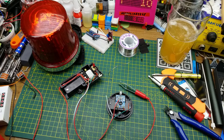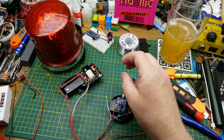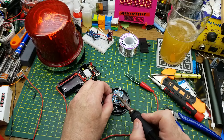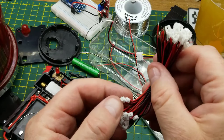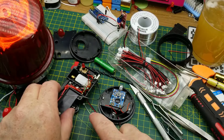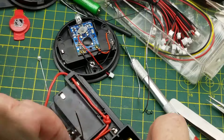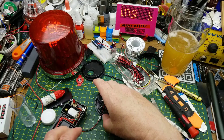I'd like it to be reversible because I don't want this permanently attached since my brother does use this during hockey season when he's got friends over to watch the game. I'll have to come up with some sort of little plug. After digging around my stockpile I'm going to use these tiny little two-pin JSTs - they're keyed so they don't get connected wrong and they're nice and tiny so they won't get in the way. I've poked a couple of holes in the plastic casing and I'll solder these down, then reconnect and try it again once it's reassembled.